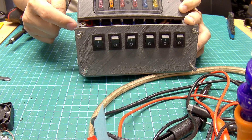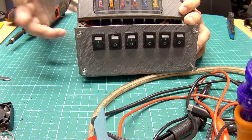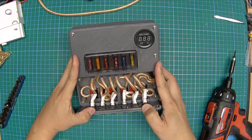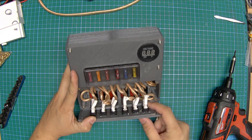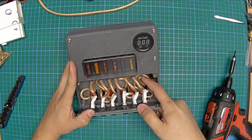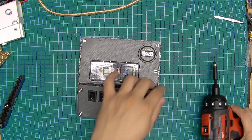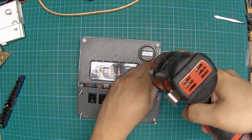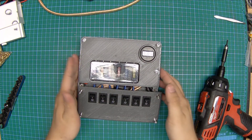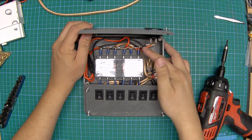These are heat welded brass inserts with an M3 thread and they hold on for dear life. You will have a hard time stripping these PEM inserts out as long as you don't completely over-torque them. If you go to normal torque for an M3 fastener, you're fine. Going back to the construction of this itself, it's pretty straightforward — just a bunch of rocker switches, some spare 12-gauge speaker wire I had laying around, and a bunch of power poles in the bottom. When you fasten the panel down and all the screws are acting to help hold the unit together, it's very strong. So that fulfills my main criteria for building one.